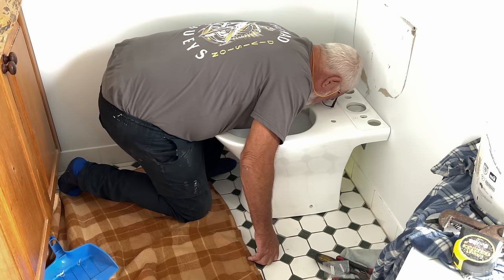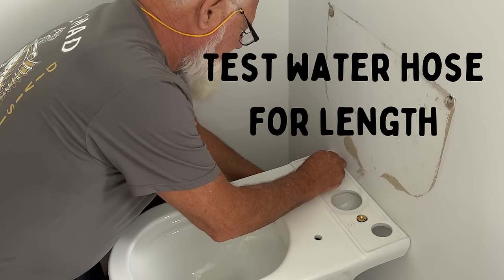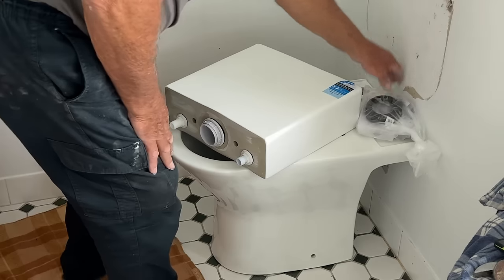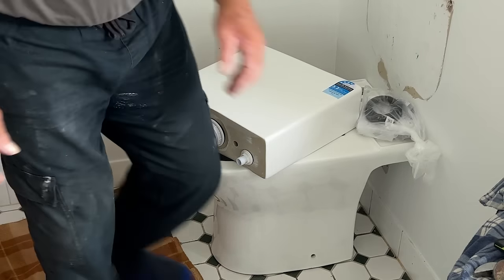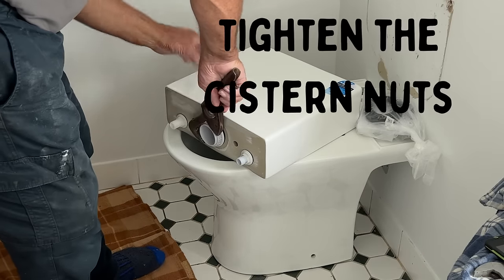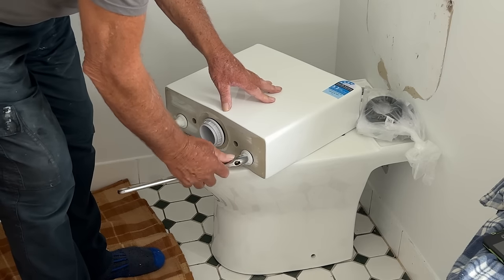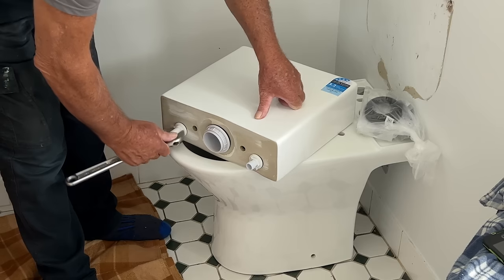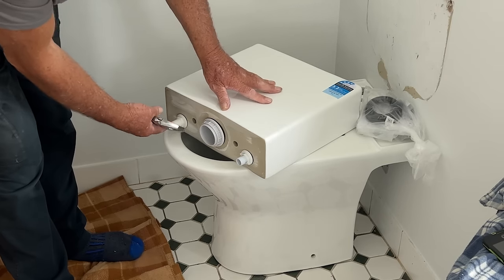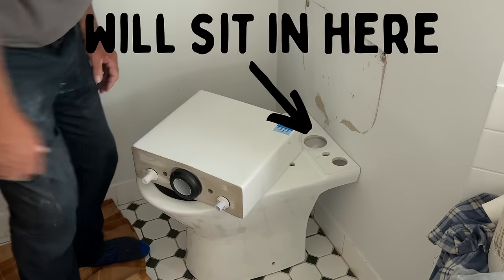As we can see there's no water — before we get too carried away, we want to find the right inlet hose. Your water inlet needs to reach from the tap up to the water tank. A very important step that's sometimes overlooked with the DIY dunny is that you actually need to tighten up these cistern nuts. Use a spanner, make sure they're nice and snug — don't overdo it because they are plastic — but these aren't tightened up in the factory, they're just mock assembled. One connection is the inlet and the other is for the pan. The inlet's on the left; you can see it sits down in there. Always read the instructions.